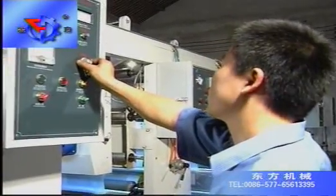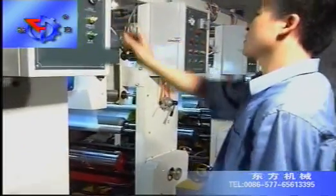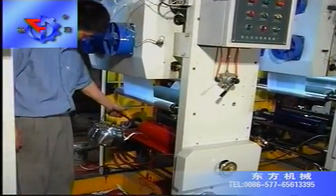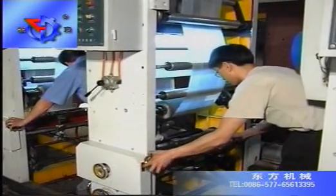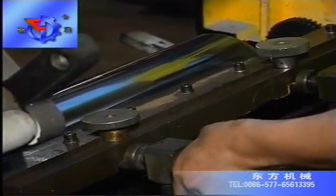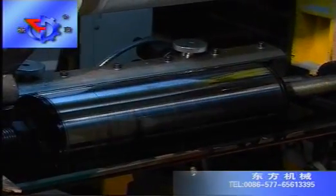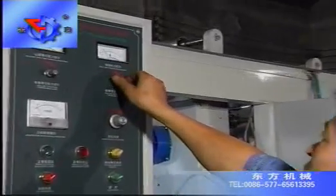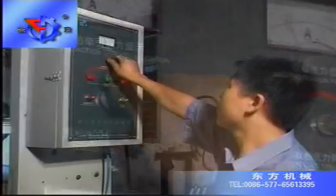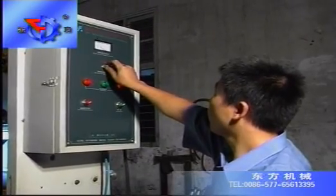At steady speed, feed the oil ink until every printing roller is submerged in the oil ink plate. Mix the oil ink in the correct proportion with dilution liquid. Adjust the ink scraper angle. Clean any excess oil ink from the roller, then adjust the press roller. Keep the color printing plate at a constant tension.